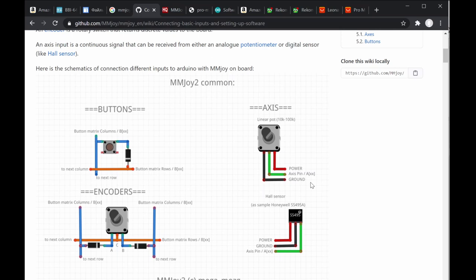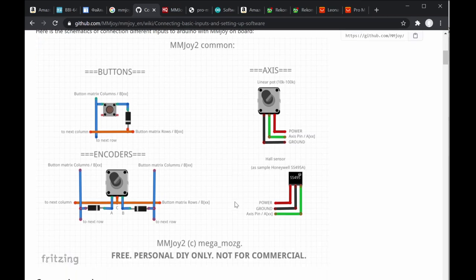Shift registers have simpler cabling because all the switch grounds can be connected with a single wire across the switches. With matrix wiring you need more complex routing. I don't have my design examples handy right now, but if you want one you can message me and I'll send you my designs for push button panels or even the cockpit design.